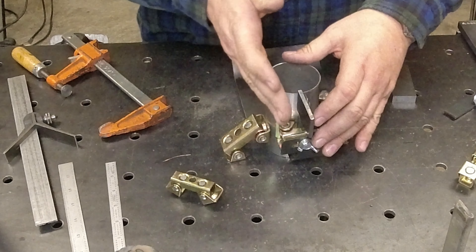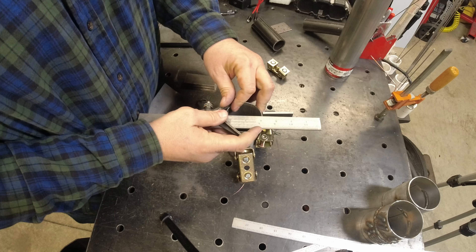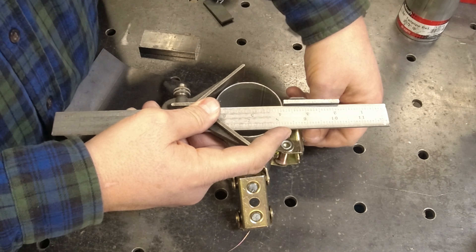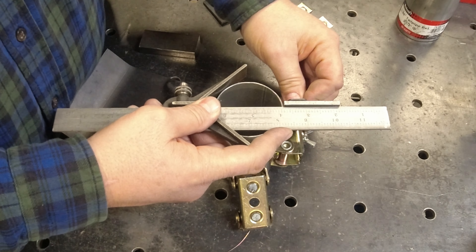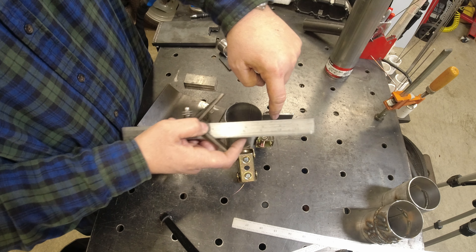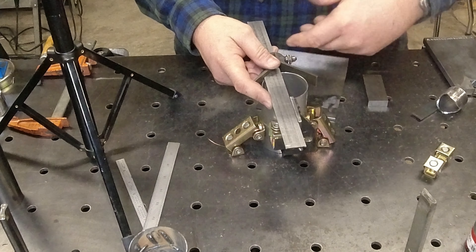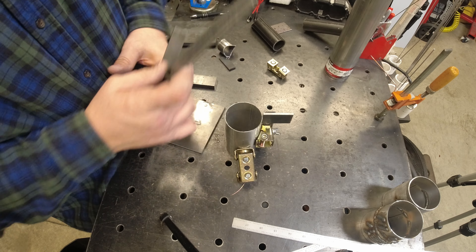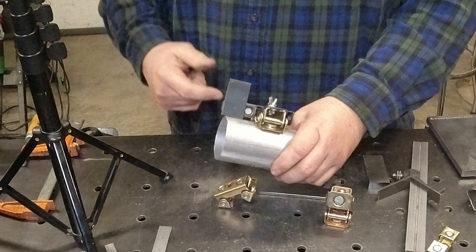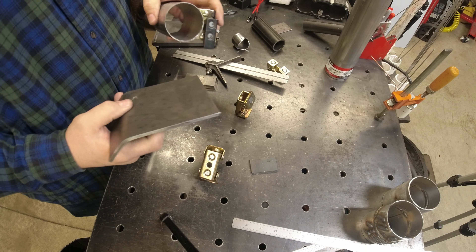In the center — and you get to choose where in center it is. So you just take your centering attachment, set it on here, and this is going to put it in center. If there's a gap, you just loosen it and slide it in or out until the gap is gone. You have to decide if you want the center on this side or the other side, and then once it's set, you just go through and place them wherever you want. Once you have it, you mark where you want the center of your tab, weld them on, and every time you put it on it's going to be in the center of the tab.